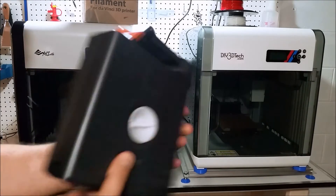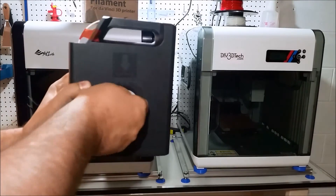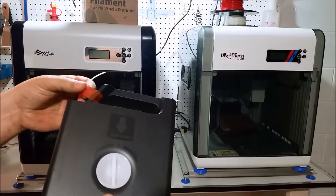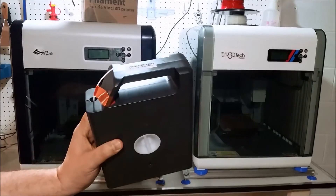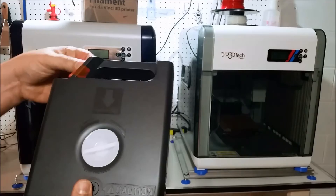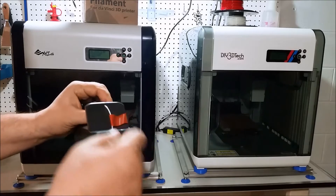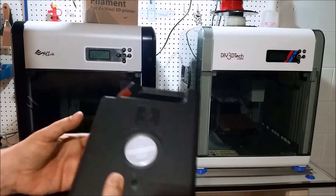The other piece is this locking mechanism — you can lock or unlock the filament. Turn it this way to lock it, this way to unlock it. Make sure it's unlocked when you go to put it in your machine. This is here because the filament end is taped so it can't retract. When you go to change cartridges, if you don't lock the spool, the filament can get pulled back in. When storing, I would lock the spool, tuck the filament end back in, and put a piece of tape over it.